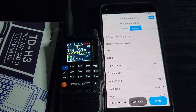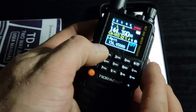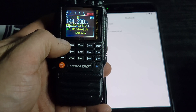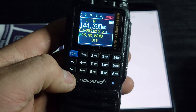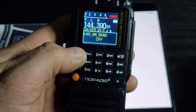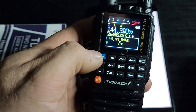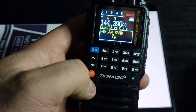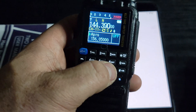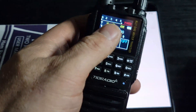Just a quick rundown of the TD-H3 — pretty neat little radio. I love the fact that we have aircraft band. The aircraft band is accessible here. We're going to go to menu 48 — AM band — and AM band needs to be on. I noticed a couple of times that it got turned off again, so you're probably better off having the open firmware. AM band on, confirm. Now when you go to 119.4, it says AM. That's the air band working.